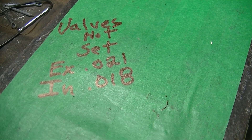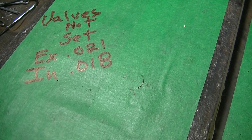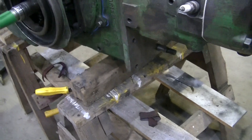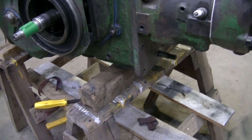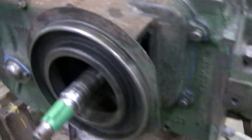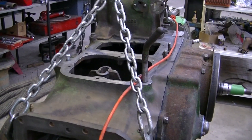The internet says the exhaust is 21 thousandths on this and 18 on the intake. So it's coming — a lot of work here yet. Fortunately I cleaned most of the parts ahead of time, so I was able to grab stuff and work with it with a little cleaning. Anyway, that's where she's at now. YouTube user Zeke the Antique Freak — over and out.